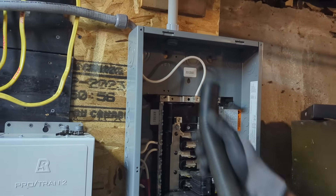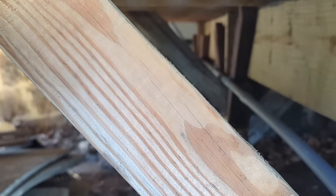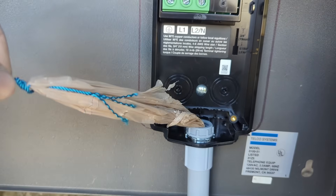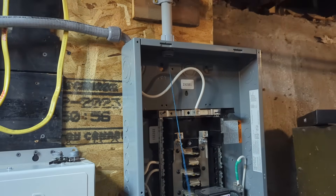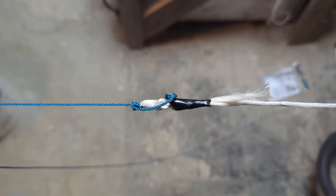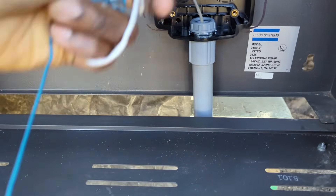The next day I got my brother to help me since I knew I was going to be pulling the wires. It's always better to have two people when pulling wire — one can be pushing and one can be pulling. I got the vacuum going on the inside with a small piece of bag at the end of a string, and the vacuum was able to pull the line through. Once the string reached inside, I attached a stronger piece of string to it and pulled it back outside. This thicker, stronger string would be used to pull all the electrical wires.